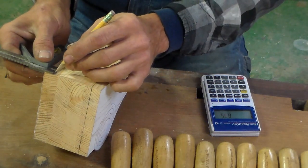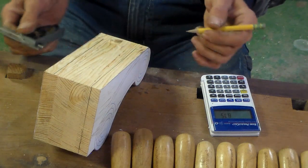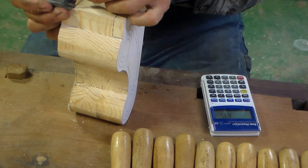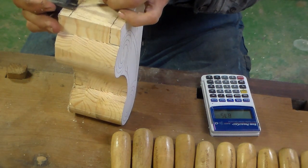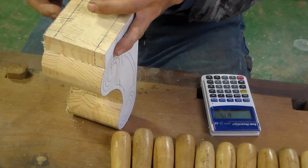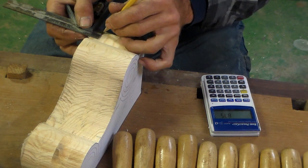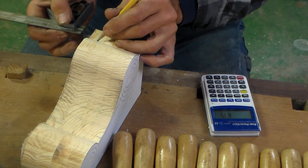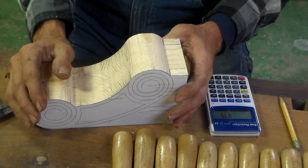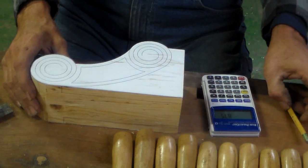This is just select yellow pine picked up at Menards. Nothing real special. I prefer carving in hardwoods, but the client's trim in the house is pine, so we're going to match it. It's stained with a colonial maple stain, it looks like, so that's what this is going to get. So it's got to be a pretty decent look because it is getting stained and not painted. So yeah, that'll be fun.